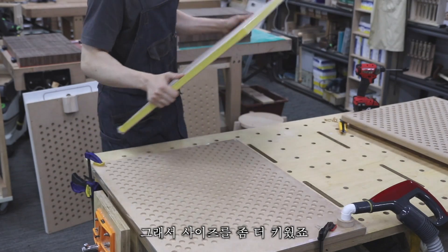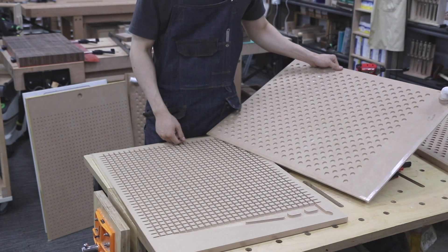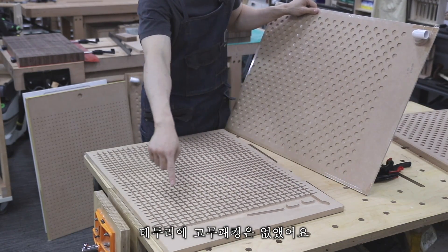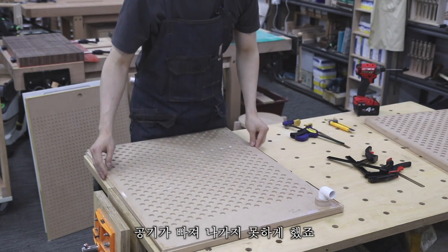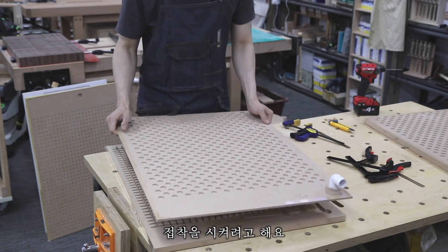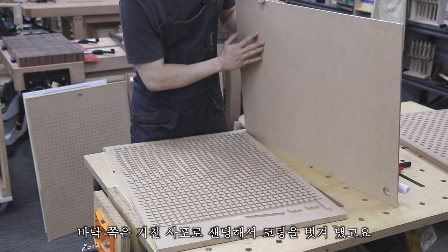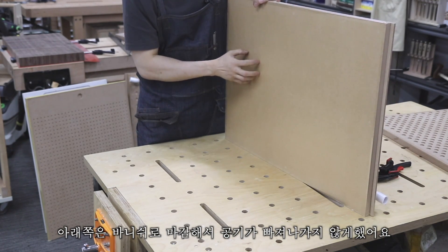So I scaled the dimensions back up. In my revised version, the air hole depth and width match Peter's original, but I moved the air intake to one corner. I eliminated the rubber perimeter packing, and instead sealed the sides with tape after attaching the top plate — though I plan to bond it permanently with adhesive after filming. The top plate thickness is 6T, leaving about 2mm of MDF. I sanded the underside of the top plate with coarse sandpaper to remove the factory coating, and finished the bottom face with varnish to prevent air loss.